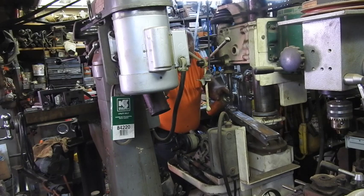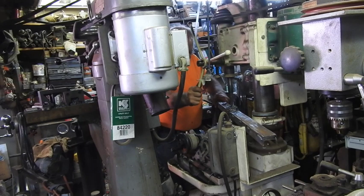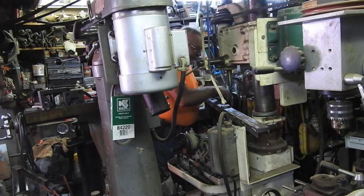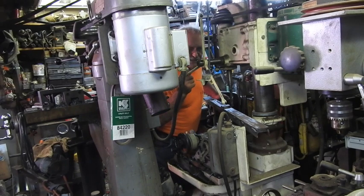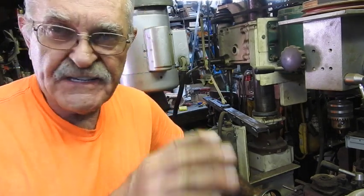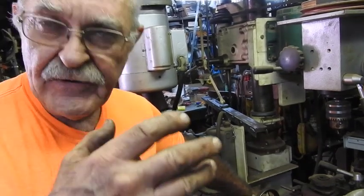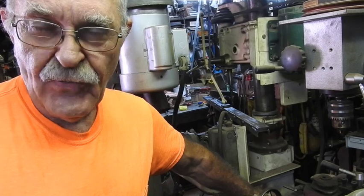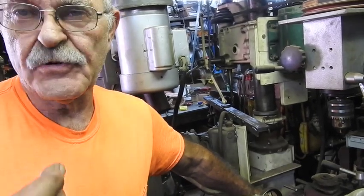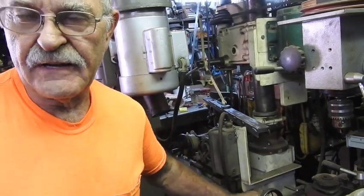You can see the ribbons coming out - we're drilling through 1-1/8 inches of steel. When you use old equipment, old materials, old drill bits, old tools, even tractors, you have to be willing to make concessions. On my drill presses I like to run the belts loose because when the drill bit catches, I'd just as soon the belt slipped as to catch a piece of metal and flip it around and catch me in the back of the hand. That way you're forced to kind of go slow - you can crowd them a little bit, but once they start sticking, back off. Probably not recommended, but it is what it is.